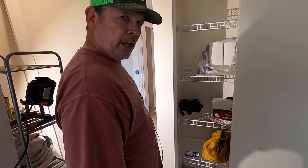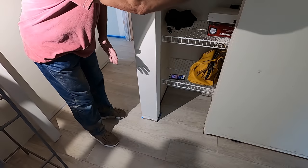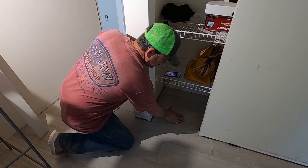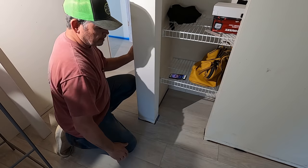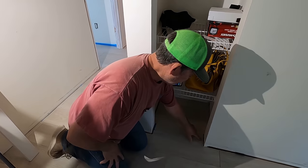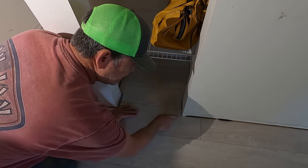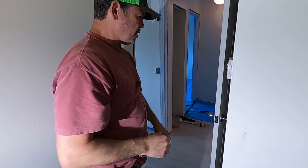Now what we found and what you saw in the videos was when the doorway is parallel to your run, we're simply notching it like this. And then when you put this piece in, also notched, it clicks in and falls back over. All the doorways that are parallel to our run so far, we've had a seam here, so it made it easier. We haven't yet run into one where we had to notch it this way, but all the others are notched the other way. Let me show you what I'm talking about.